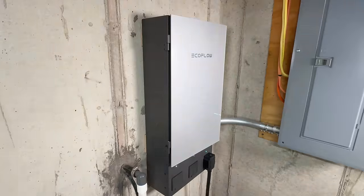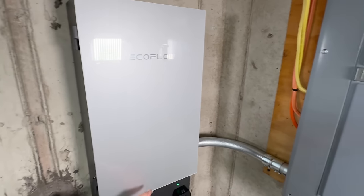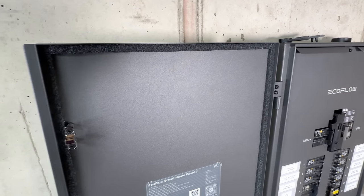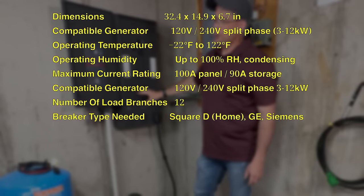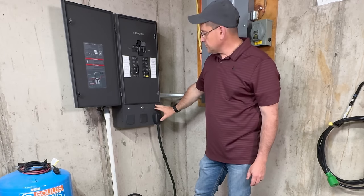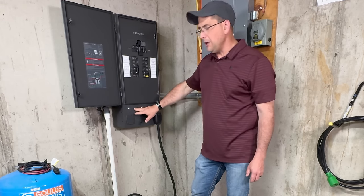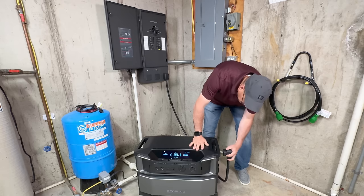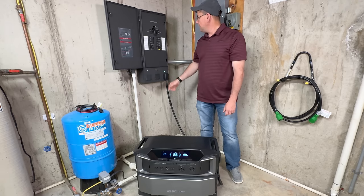We're finally to my favorite part — the Smart Home Panel 2. Looking at this front cover, it is a glass front with their logo on it. Very attractive. It is NEMA 3 rated, which means it's rainproof. It has a dust shield on the inside panel. You can mount this outside on the outside of the house, or inside. The bottom section is not rated for outdoor use but is separatable from the top, with four wing nuts, and you can run conduit from this to the actual switch mechanism. To plug this in, you simply grab the plug, plug it right here on the side, lock it in — it's got the same twist lock — and right now we're ready to rock and roll.